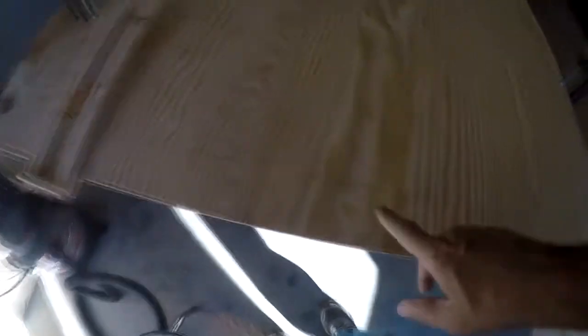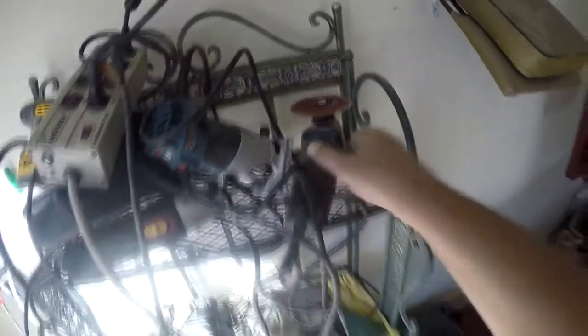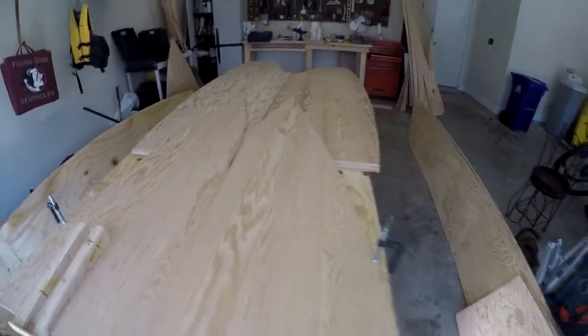Now I'm fixing to do the starboard parts and the scarf joint. One thing I'm doing is once I'm done scarfing, I hit the top part with my grinder just to make sure I have a proper notch there - since the gradient goes in so slowly, sometimes the point at the end isn't quite pointy enough. So I'm just making a small line, maybe a 16th or 32nd of an inch, with the grinder after scarfing - just knock the top off. Then I'll get them sized up and ready for epoxy.